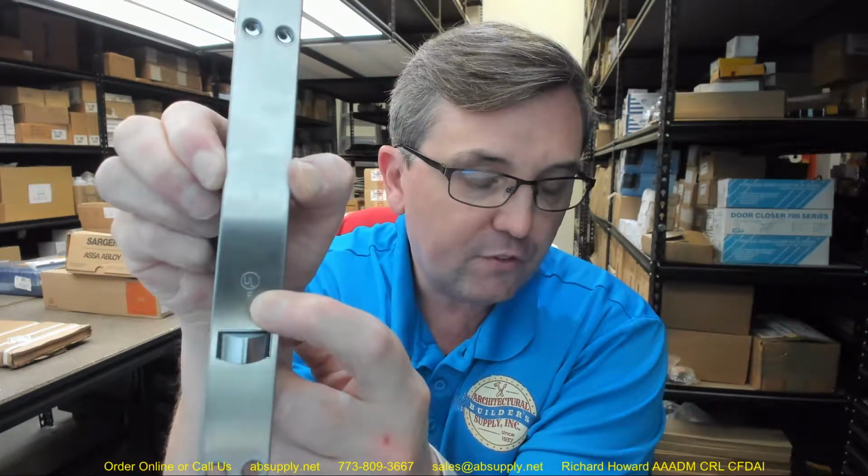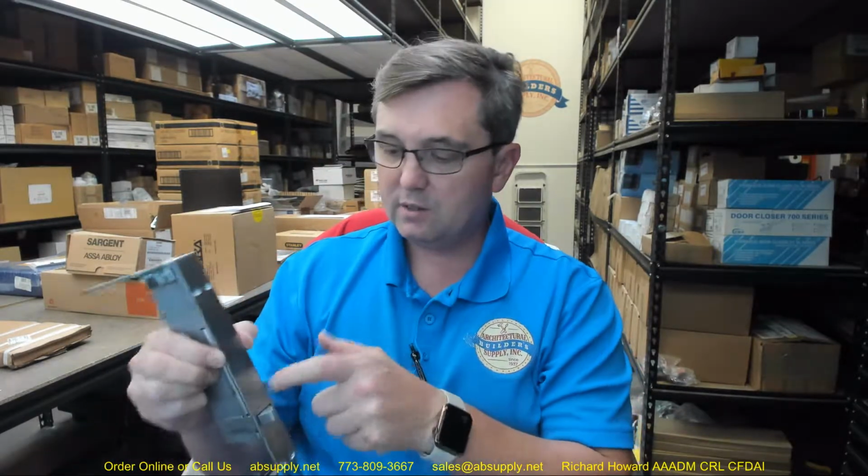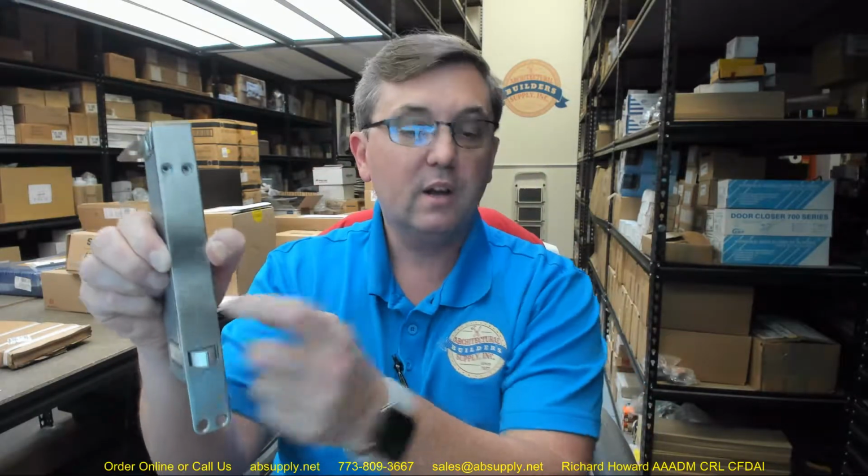This does bear the visual evidence of the fact that it is approved for use on fire-rated doors, an F or a UL. There are other symbols that you can see. That tells visually an inspector, a certified fire door assembly inspector or egress door inspector as myself, or the authority having jurisdiction, most certainly, this is permitted to be used on that fire-rated door. You could go back to the manufacturer of this bolt and say, produce for me the paperwork from UL that states this is conducive for the fire door assembly. And of course they could do that upon demand without any trouble whatsoever.